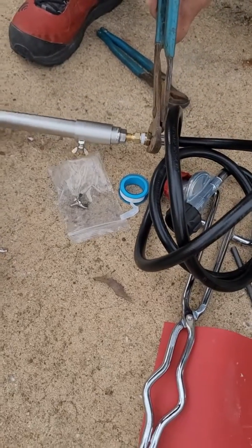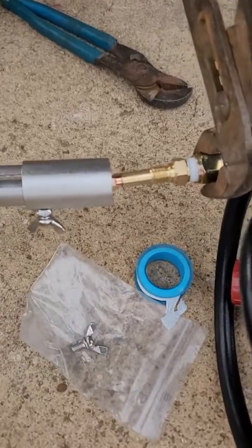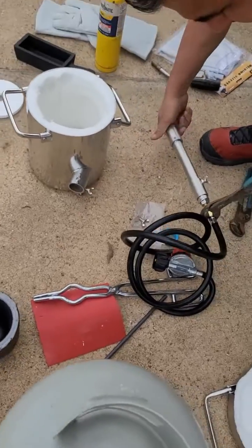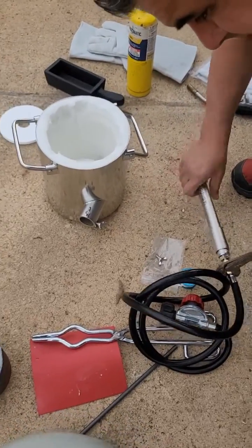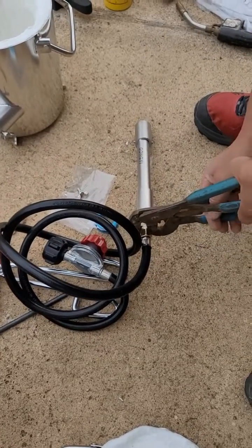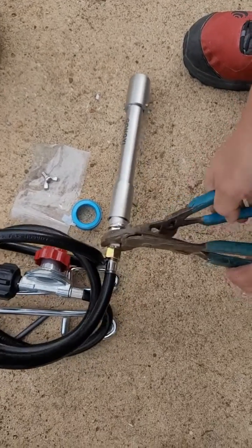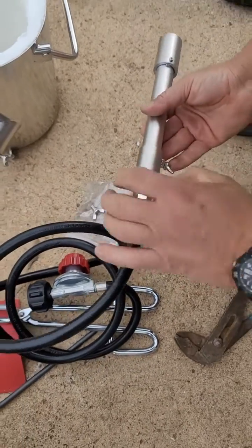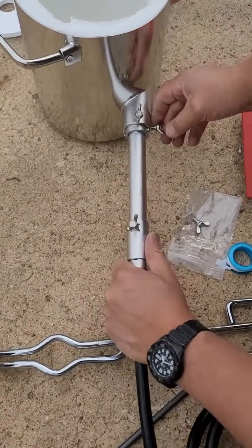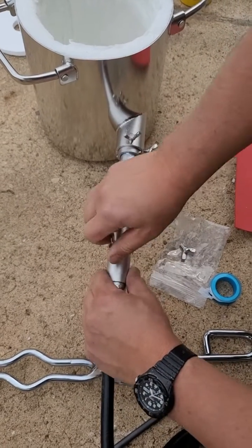The inside connection is not suggested to have Teflon, so I'll just apply pressure. I'm using two vice grips — the reason is you don't want to put too much pressure on the hose or the fitting. Grab it from the opposite direction and then fasten the fittings. That's an important method: when joining two pieces, don't rely on the strength of just one, or you can damage it.